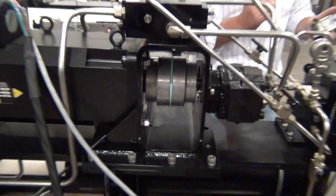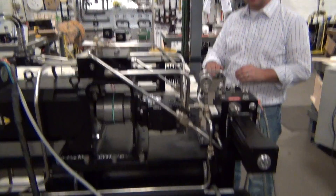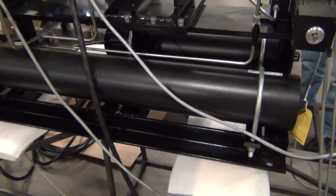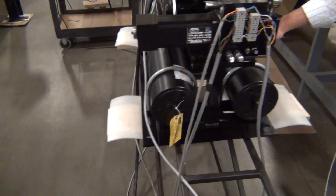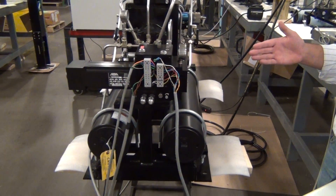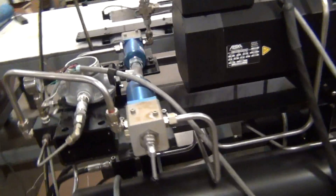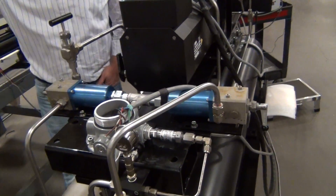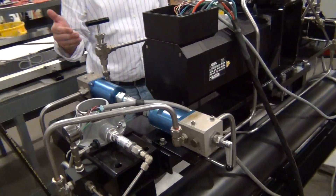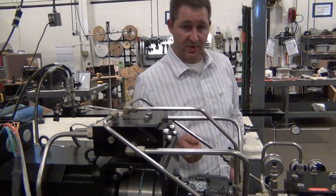This would activate normally in a load rejection or turbine trip situation. We also have a fail-safe function built into the device for loss of electrical power or a trip signal where you want to drive the valves closed. For this function, we have an accumulator system located here — it's compressed nitrogen. When you lose your signal, trip signal, or power, solenoid valves open, allowing the nitrogen to push the oil through the system, stroking the cylinder very rapidly. When you reapply your trip signal or power, the motor and pump recharge the accumulator until it is ready for another failure trip, then the solenoids close and you're back in normal operation.